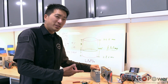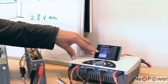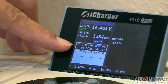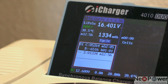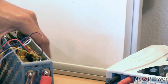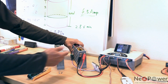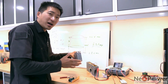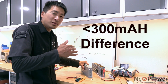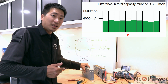After hours of waiting, the result is out. You can see this charger charged up the battery for 500 milliamps and then discharged it all the way for 6,500 milliamps — that's the number you're looking for. The true capacity of this brand new lithium blade is 6,500 to 6,560 milliamp-hours. Before you install it back into the car, you need to make sure all other blades are within the same range — 6,500 or maybe a 300 milliamp delta. That will ensure there will be no error codes and the battery will last for a long time.